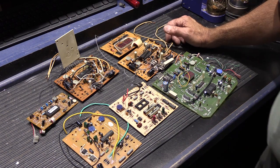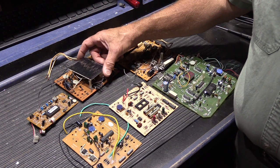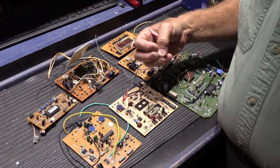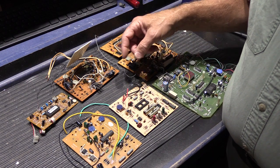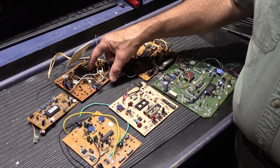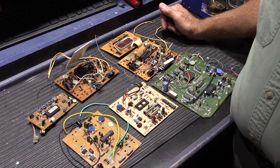An LB-55 would have had between 18 and 24 pre-programmed songs, which are reasonably long, so you needed a place to store the information allowing the chime to play songs as designed. A microprocessor was the component of choice. The microprocessor also has the ability to control the operation of the chime, so you get a lot of benefits from one component that can do many different things.